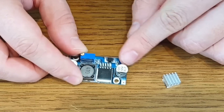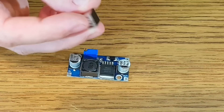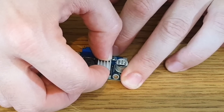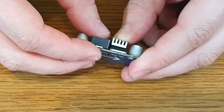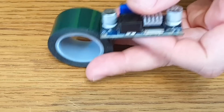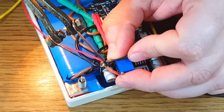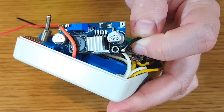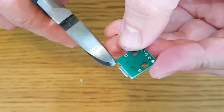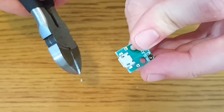To increase the voltage to a stable 5 volts needed by all USB devices, I will use this step-up converter. The IC will get a bit hot when it delivers more than 1 amp, so this self-adhesive heatsink will help to cool it down. The circuit board will also be insulated with foam tape. There is only one remaining place where the module can be mounted, so I solder the wires and insert it in position. To better fit the micro-USB breakout, I will cut the circuit board corners.